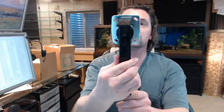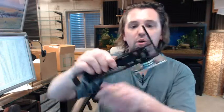Tip the door into the opening. You're going to want to mark your holes in the floor. You're going to want to get an idea that everything is margined correctly. You've got equal margin, and that the door is actually going to open. You want to mark that. The floor plate does have slotted holes to allow a little bit of play with that. Not too much, but a little bit. Once you get it all marked, you can drill your holes in the floor, get the door back in, secure it down. At that point, obviously test your operation and make any adjustments necessary.